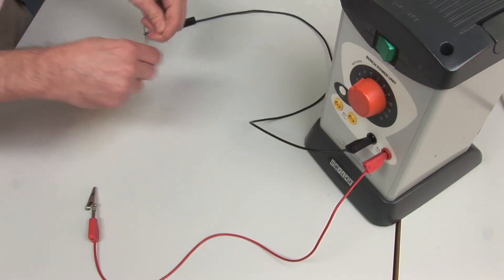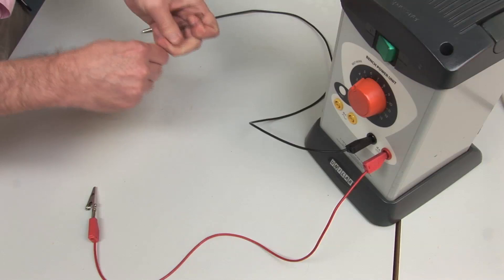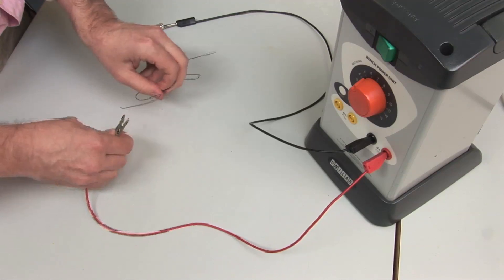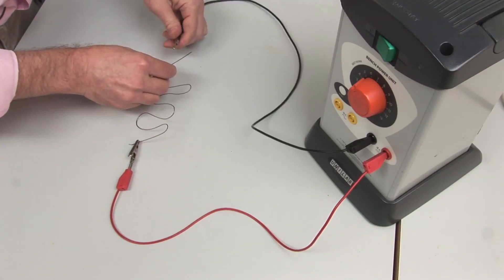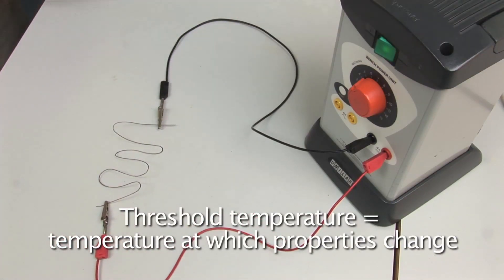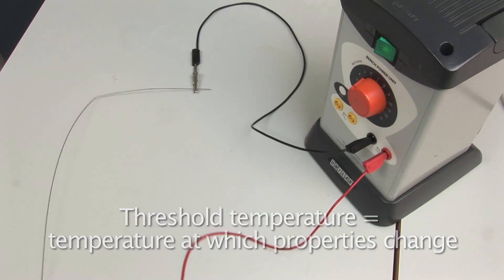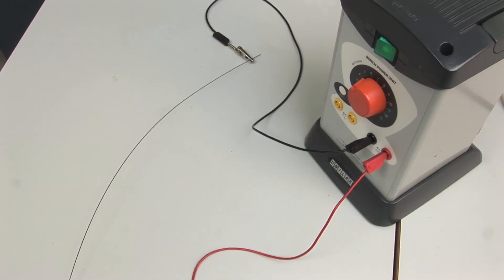Like NASA's concept aircraft, this wire is made from a nickel-titanium shape memory alloy, or SMA. You can bend and twist it like a piece of steel wire. But when you use electrical current or heat to raise it above its threshold temperature, it enters what's called a super-elastic state and remembers what shape it used to be. By making SMAs with different threshold temperatures, designers have been able to make use of their super-elastic powers.